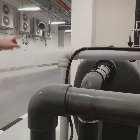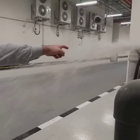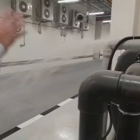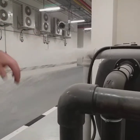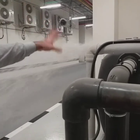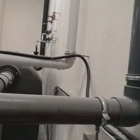Now this water is supposed to be inside the truck, not here, because this is grease water. But now we are doing this just for training. So throughout the stage, this water will go inside the truck. You can see there's a high pressure, there's a very big flow, so this will be cleaned very fast. Usually this stage will take between 40 to 50 minutes once every month. If you can see here, we are now arranging partial disposal. We have a total of 13 stages.